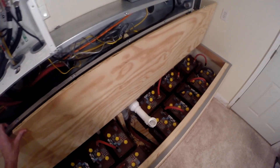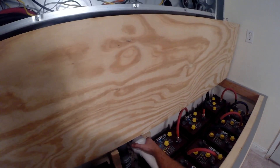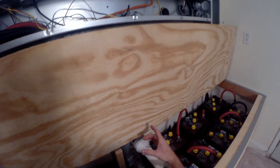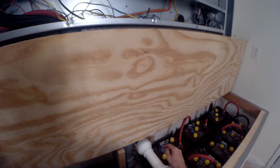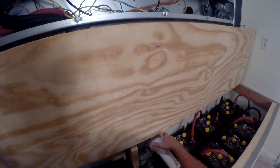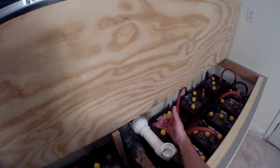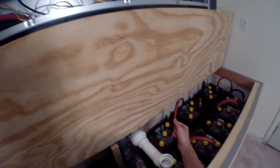Here's another mistake: this vent is designed to be vertical. It's got a little plastic plate inside that when you turn the fan on, it blows the plate up and air can come out. When the fan goes off, gravity drops the plate and makes kind of a seal so air won't come back in from the outside. By laying it down horizontally, which a lot of people do, that little piece of plastic is not going to close by gravity, so it's not really going to seal off.